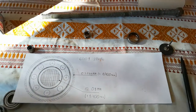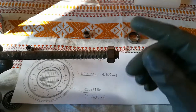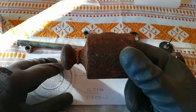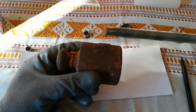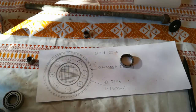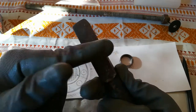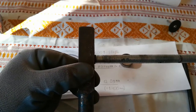Unfortunately I don't have it finished, but it's a simple tool. We have this all-threaded rod and one nut, and then we need something heavy, like a weight — a piece of metal is going to do just fine. Drill a through hole in it and then put it over the thread. As you hammer, it's going to pull the bearing out. To connect the outer race and this tool, take a piece of steel like this, drill a through hole. You can thread it or you can just weld the all-threaded rod like this — it's going to work.